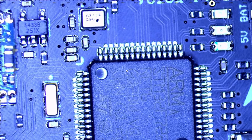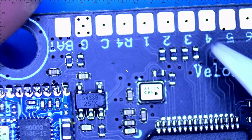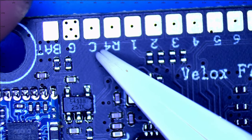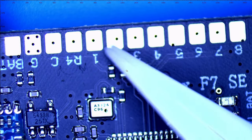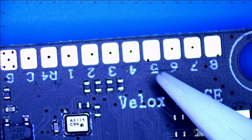Alright pilots, I'm excited to jump into this layout because it's very nice and they did a good job. So let me show you these pads. This would be like your ESC stuff — battery, ground, your control, your telemetry, which is R4. Then you've got motor pads one, two, three, four if you were going to run a regular four motor deal. Then you've got five, six, seven, eight if you were going to run eight motors. It's pretty cool that all that's there.